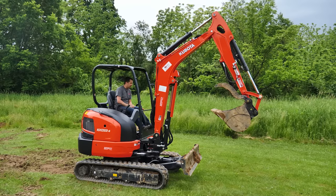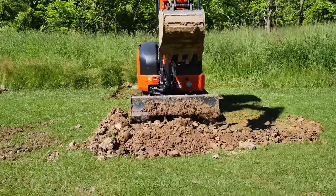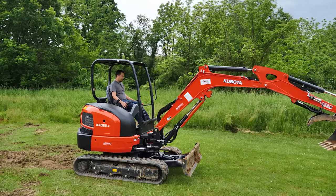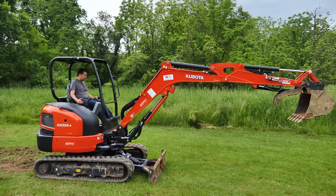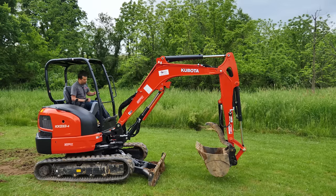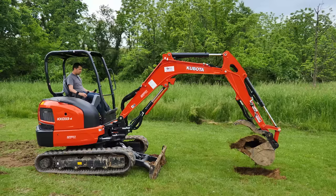The first thing we're going to talk about here is the blade. The blade serves a lot of different purposes. Most guys would look at this and think it's there to push dirt, which it is — you could use it to backfill your holes and that kind of thing. But it actually serves a much more important purpose in manipulating the pivot point of the machine. When you're going to go dig a hole, you generally want to be digging and working over top of the blade. The reason for that is if I lift this guy up and reach out with the boom, you can see here as I get all the weight from this boom out beyond the machine how easy it is for me to pick up the back of the excavator. If I take the blade and I put it down on the ground, I can now move this thing around and keep the machine planted and not be bouncing around here in the back. That's simply because that blade is moving the pivot point forward beyond the tracks. By going forward that extra 18 or 24 inches so that the blade is forward, it makes a huge difference in the machine's stability. Anytime you're starting one of those digging projects, you generally always want to be over top of the blade and digging in front of it.